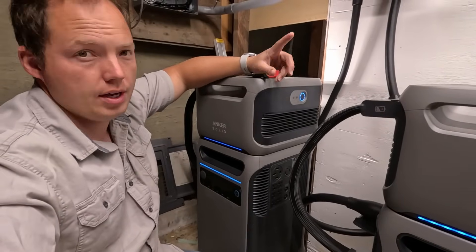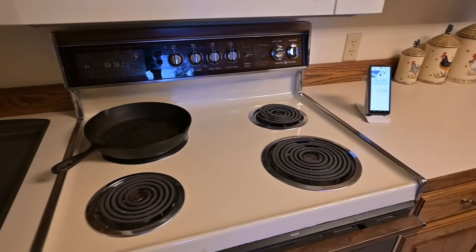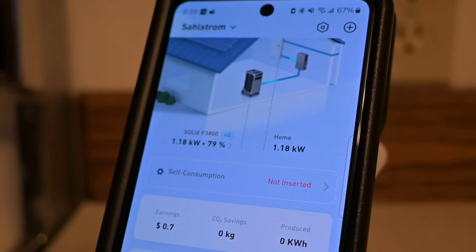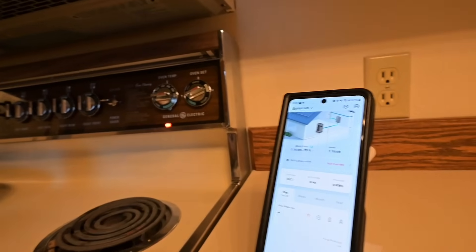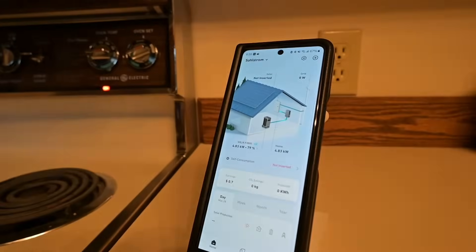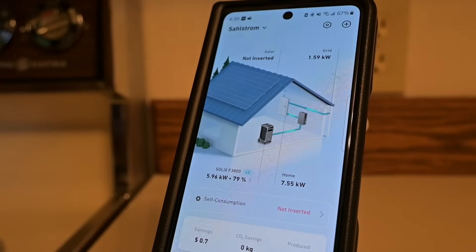I think I would need to add some more loads in our backed-up panel and be able to take advantage of the full 12,000 watts, but I need to move some of the circuits over in order to test that. I got the electric range moved over into the backup panel and we're going to go ahead and fire it off. Right now we're in self-consumption mode, which means the Anker Solix F3800 is going to use the energy inside of it so that it has more capacity to take charge from solar sources. We should be able to turn this on and set it to bake, which is going to dramatically increase the load. Right now we've got our grid at zero watts, 4.8 kilowatts coming from the F3800s because we've got the two of them connected. Now let's turn on a couple more — that should bring us above six kilowatts, which it is, but right now it's still going to be outputting just that max of basically six kilowatts.